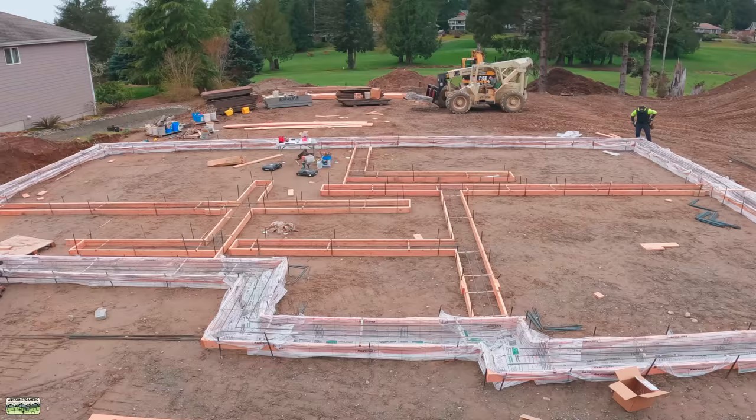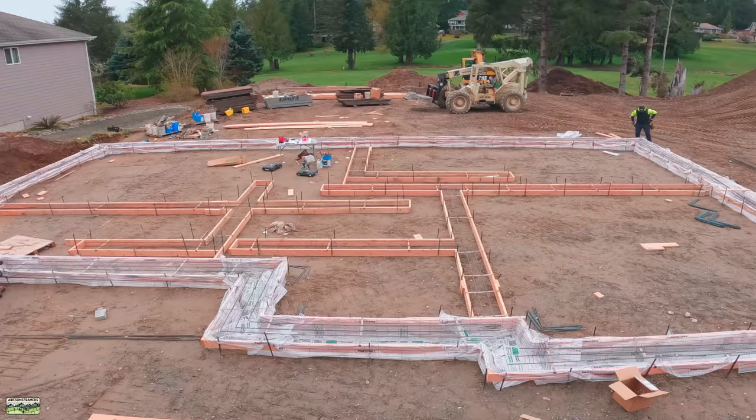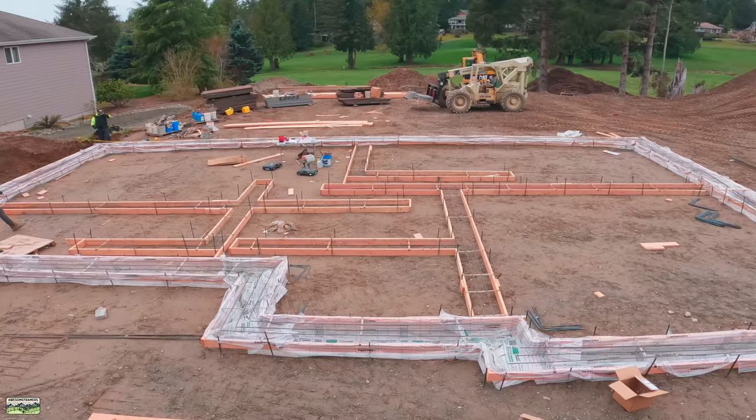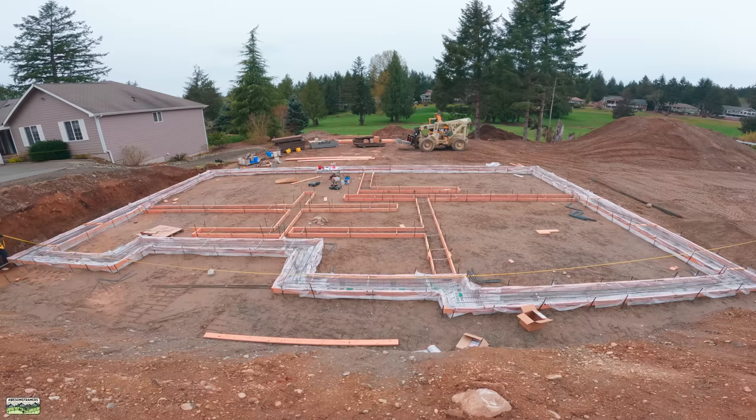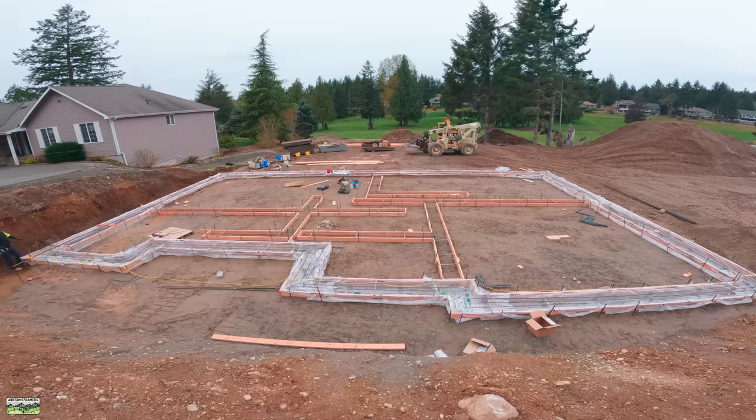So let's go through this process. You can see the back wall is 64 feet - we just shot a perfectly straight line and tack nails on the forms on each side. Then coming forward on that right-hand wall is about 40 feet - same thing. Now we're perfectly square. It's time to roll out the 100-foot or 200-foot tape. I'm using a Stabila tape because it's steel, meaning it doesn't stretch. Kyle's on one side - we call it the dumb end, but in reality it is not the dumb end because if you mess that side up, everything gets messed up.